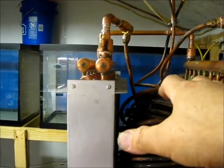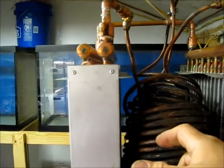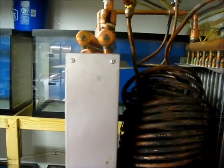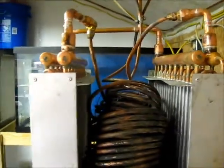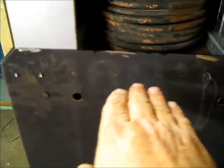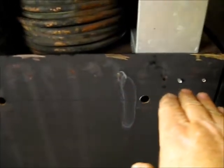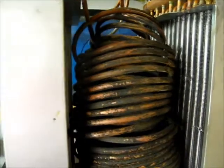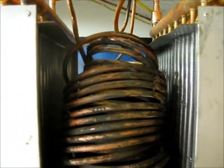He's going to put a sheet metal box over it — a double-walled affair. Then we're going to insulate the whole thing with rock wool, and he's going to wrap that rock wool again with sheet metal. So when this stove burns hot, I can take my heat gun, and right here along the top it registers about 450 degrees. With those coils and the radiators, there's 410 feet of 3/8-inch copper tubing on top of this stove.